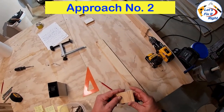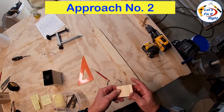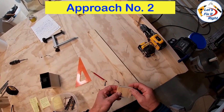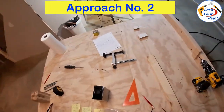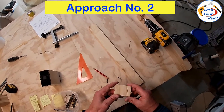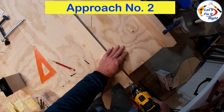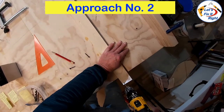My second approach is for folks that don't have a nail gun, or those who want to cause less damage to the article of interest. In this case, we have a piece of high grade pine, and we're going to secure it to the anchor board with two 1¼ inch drywall screws. Step one: drill two holes and screws.